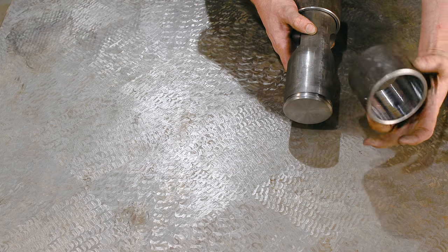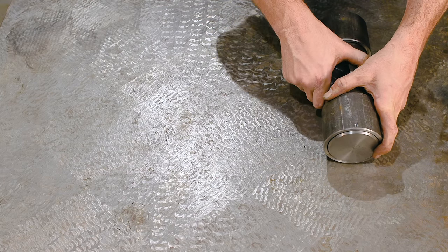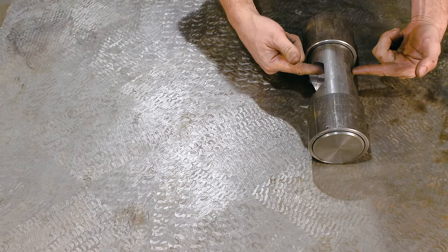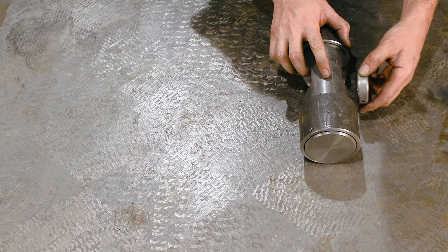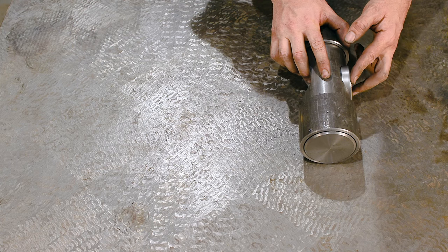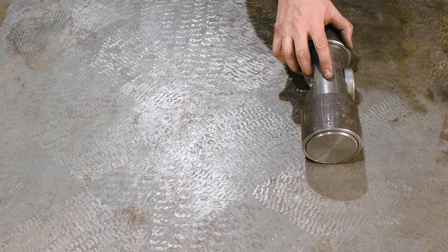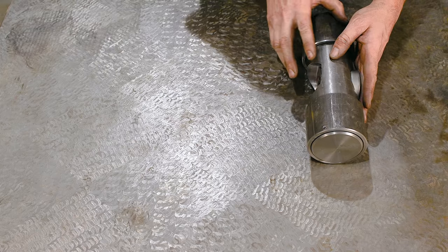This locking groove goes inside right there, with this set screw to hold it from walking out either end. Inside of this pin are going to be thrust bearings. The one on the back here is only going to be used maybe if I ever wanted to use the arm to pull. This one is going to be the pusher thrust bearing. It sits in there like that.